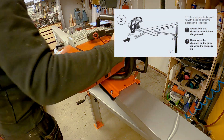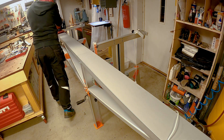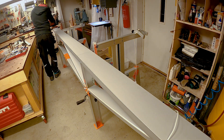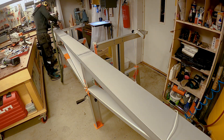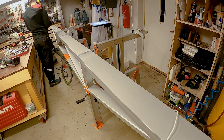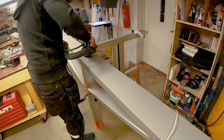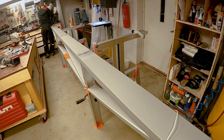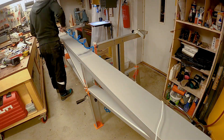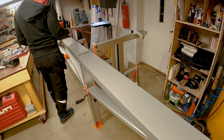Here I'm testing out how easily the saw glides. I decided to make the joints smooth on the rails by sanding them down. It's probably a stupid idea since the aluminum loses its protective anodization, but my OCD just wanted to get it perfectly flat. Afterwards, I waxed the rail, and the whole thing was smooth and silky and worked pretty well.